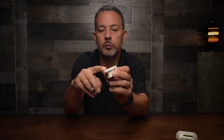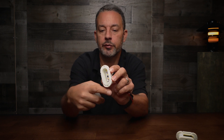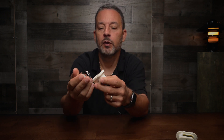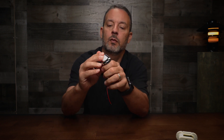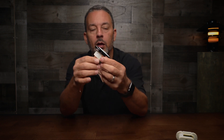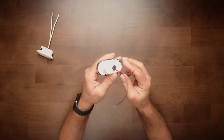It is still waterproof. There's a gasket here, so after you mount it — putting the screws right here, a couple of stainless steel screws — you'll put the cover on, slide it, and it locks in place and keeps the water out. There's no need to put any caulking on the back or sealant.